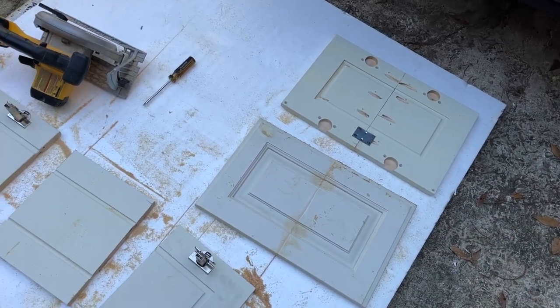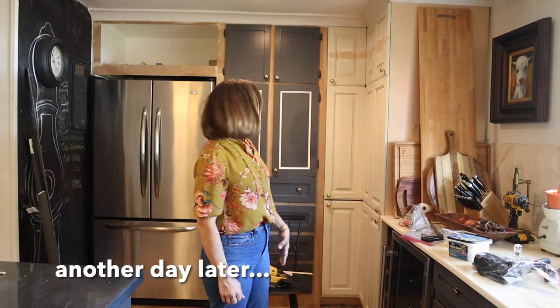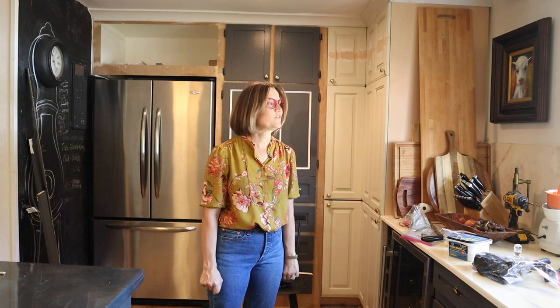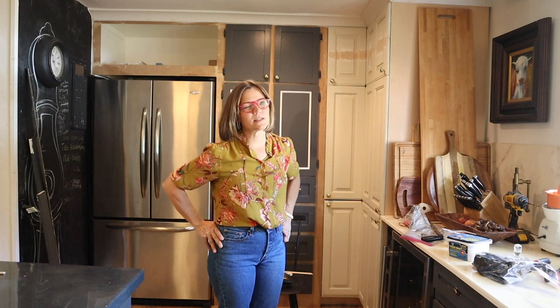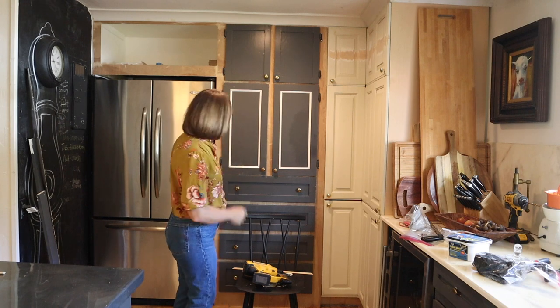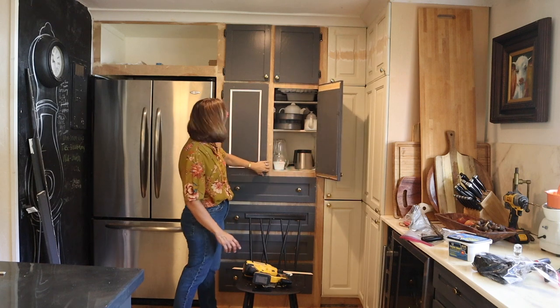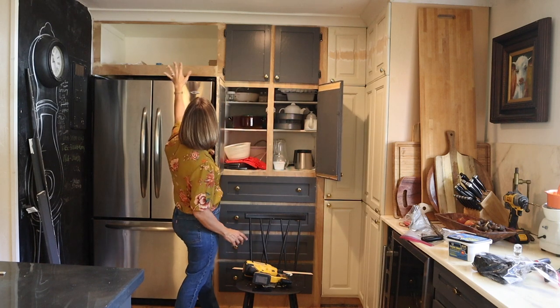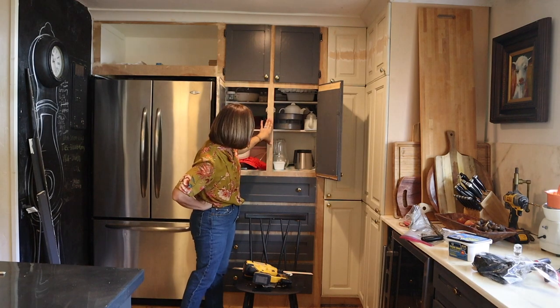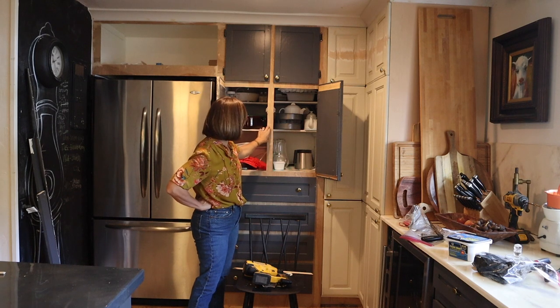This is where I'm at — day four, maybe day five. I was out of town this weekend for work and only had a half day yesterday. I did get the crown molding in around the top. What I did is take a piece of plywood and make a face frame for this whole piece, going over the entire cabinet front, so I could lower this section down to lower my cabinet doors to be level with the others.